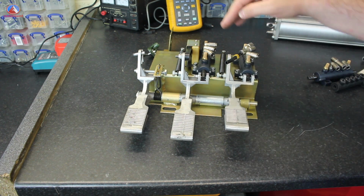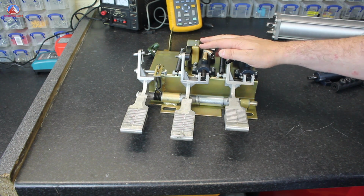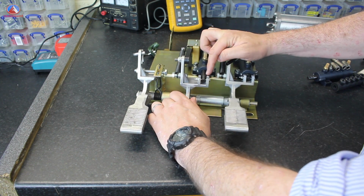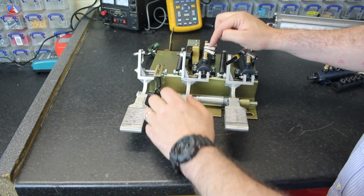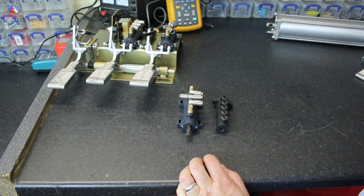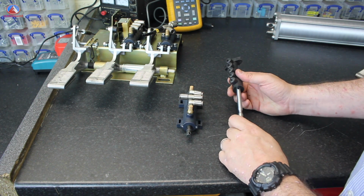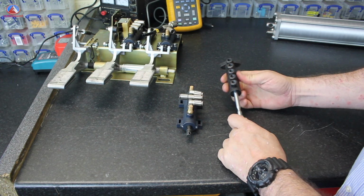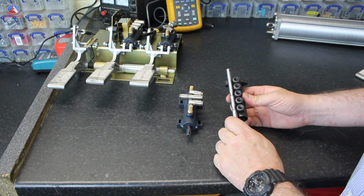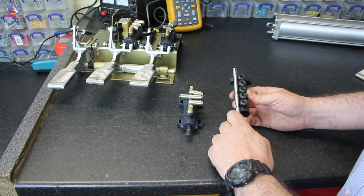These are the 2 pedals we're interested in, and in particular these 2 items here. These are the valve chests, or some people call them a manifold, and this is the shuttle which goes in and out of the manifold as it's pushed. This moves in and out and provides air to the different pipes, 1, 2, 3. I actually have one of them over here, and this is a stripped down version of it. So you have this manifold, this shuttle moves in and out of it, a bit like a penny whistle as such. And these different indentations line up with different sets of holes. I'll show you what bearing that has on the rams later on.